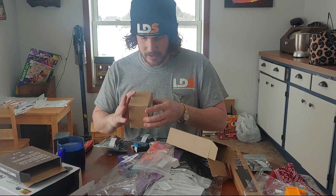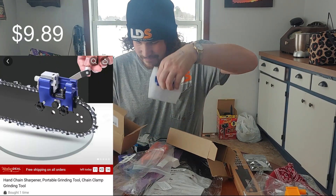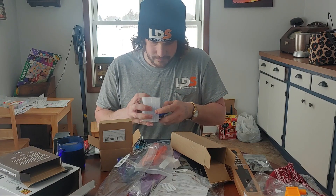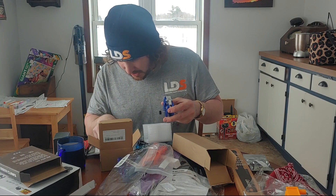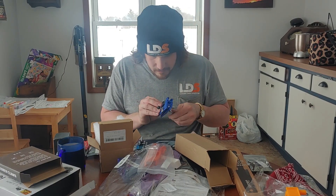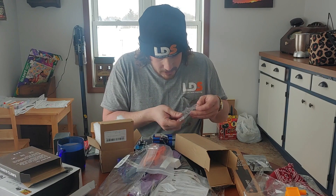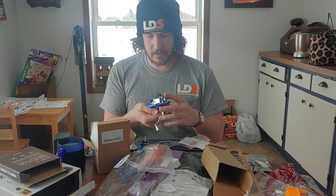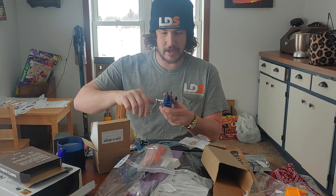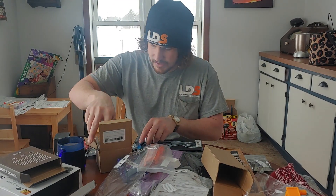I got a hand chain grinder — I wasn't sure what it was at first. This guy was only a couple of bucks. You're supposed to clamp it onto your chainsaw bar, put your little file in here, slide him in, put this on with a little lock nut. It comes with a wrench and everything. So this clamps onto your chainsaw bar and you crank it to sharpen your chainsaw chain. We'll give that a go a little bit later and I'll get it videoed up to see how it works.